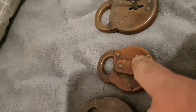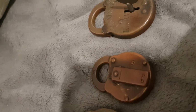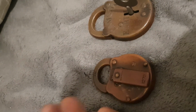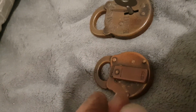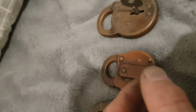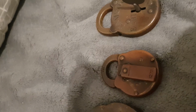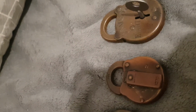It's even more critical where there's a big heavy spring, because sometimes those springs break. Here's an example of a lock that's got a broken lever tumbler, and you wouldn't know it unless you're a professional. You get the lock home and you do a little rebound on each individual lever tumbler, and you see that one sticks up and doesn't come down unless you hold or orient the lock upward, where gravity is allowing the lever tumbler to float down, if it even does at all, because sometimes tolerances are so tight that even with gravity the lever tumblers won't float back down.